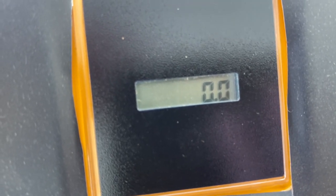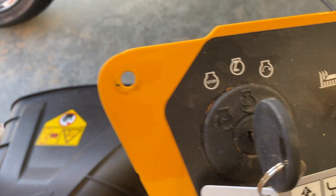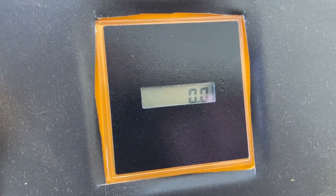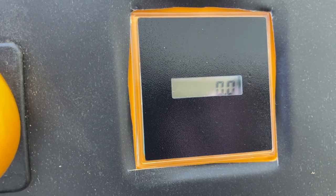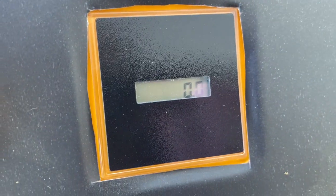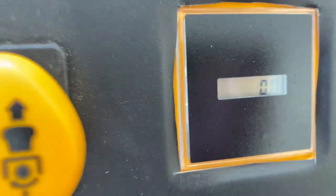There are no hours right now, but any time it is in the on position — whether or not your mower is running — it's going to be counting hours. So don't leave it like this because you'll have an inaccurate count, and also you'll be running down the battery of course.